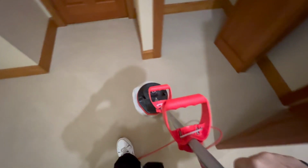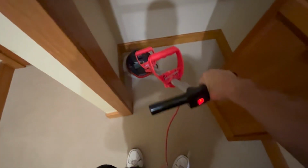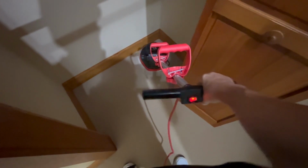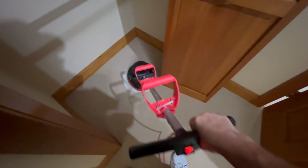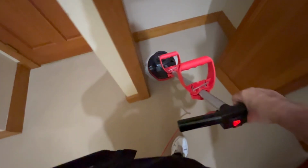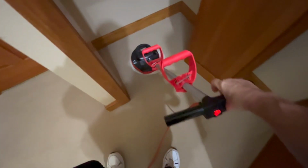Then your next step, you can use some specialty spotters, which I'll share with you later in future videos, and maybe a drill and a brush, and just kind of pre-spot a few areas that need it. This one didn't need it. I'm going to just use the pre-spray, which you see me use a 4-gallon jug that has 4 gallons of water and 4 ounces of Green Dragon, or 1 ounce per gallon. And I have a Worx sprayer, which I show you in the video.